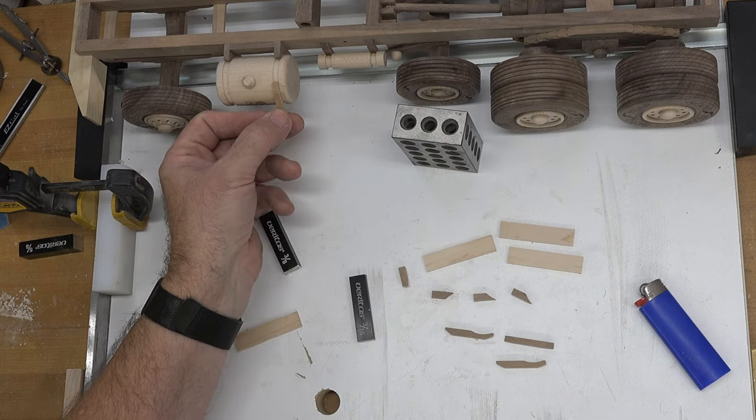However, we still need the interior of the grill. Honestly, guys, if we look here on the print, sheet 3 of 9, we can see the grill trim, making 13 of these and gluing them in place, 1/16 of an inch by 3/32 of an inch, and they get mounted on top of this grill back, which is 1/8 thick material. Guys, what an absolute nightmare. I've never been a fan of this kind of construction.